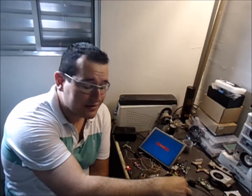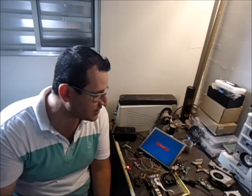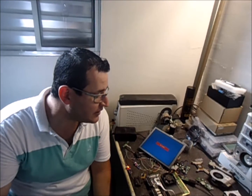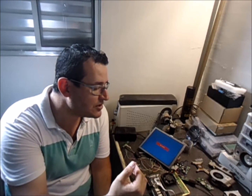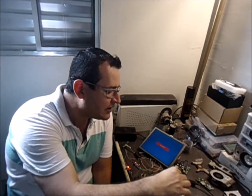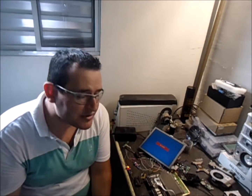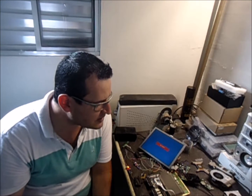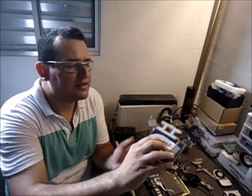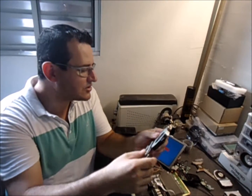The GameCube vents from the sides, so it already has forced ventilation. But when you mount it inside a case that doesn't exist yet — because I will design that case and build it from scratch — it won't have as much space for the cooling system it had before. So I thought of another way. I will modify the heatsink, and I noticed when repairing a notebook that the coolers notebooks use are flat — there are various sizes, and one fits perfectly on the side of the board for cooling.